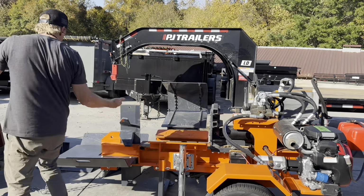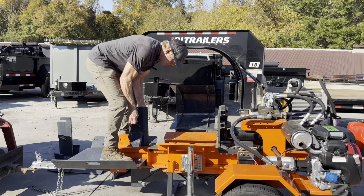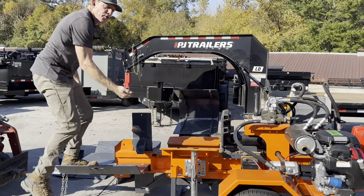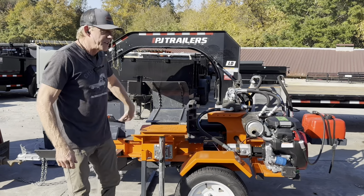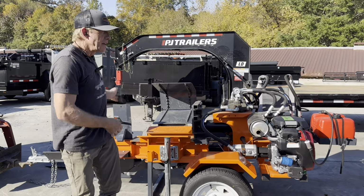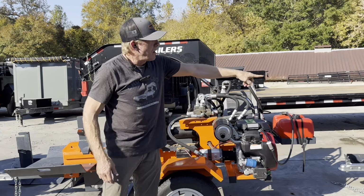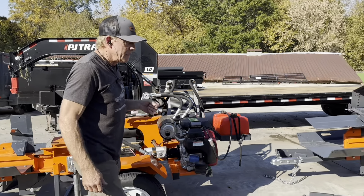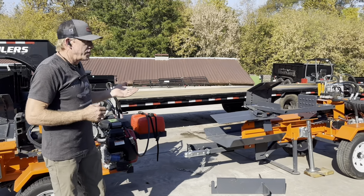Like I said, if you even bring the wedge up just a little bit, just enough that it's in its normal operating position, that cam is gonna move forward and stay engaged. So it just gives you the option to have it where it'll disengage for changing your 4- and 6-way quickly, or leaving it run out so you can keep your box wedge grabbed all the time. In the test video, you'll see me talk about running it on the 6-way.